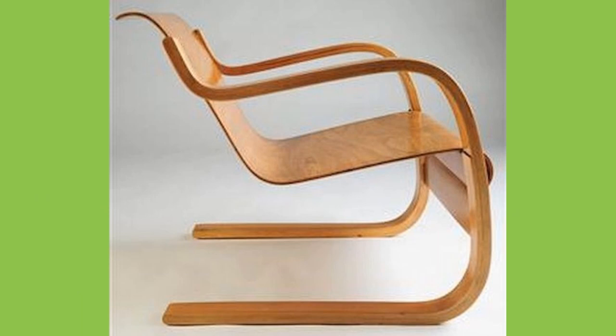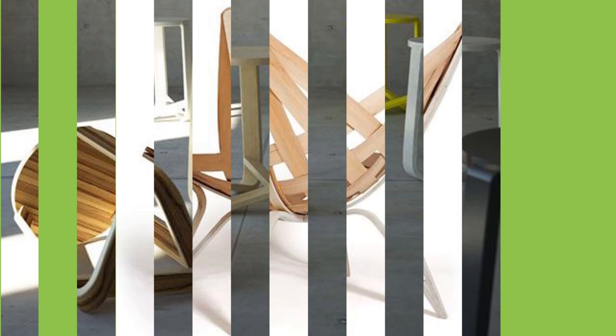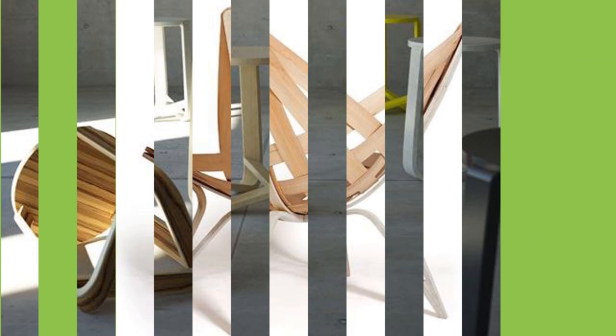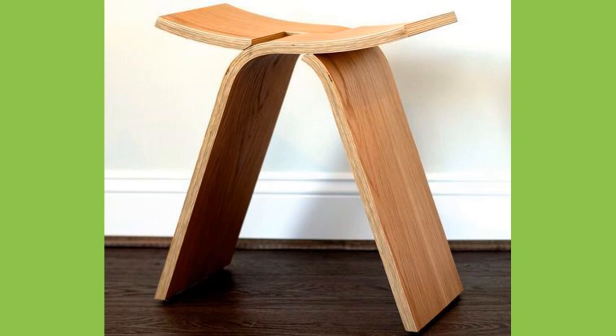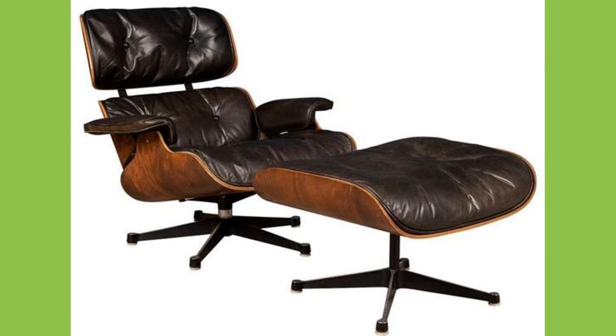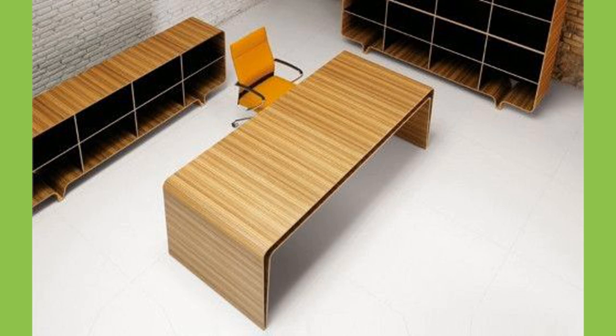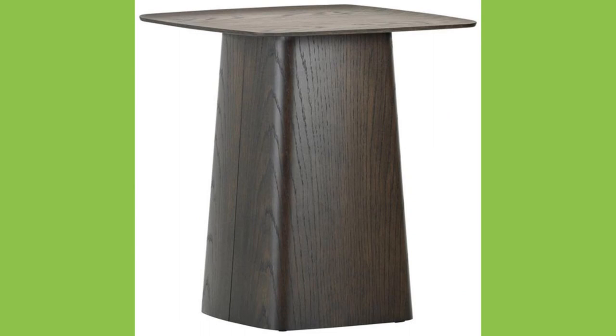The commonly used terminologies in the area of bent wood furniture include molded plywood and laminated wood. The phrase 'molded plywood' refers to parts made from at least three thin veneers that are glued together, with the grain running at a 90-degree angle to that in the next layer. This interlocking pattern greatly reduces the swelling and shrinking and generates more resistance in the surface. These properties are used in two-dimensional moldings such as seats, backrests, and shells.